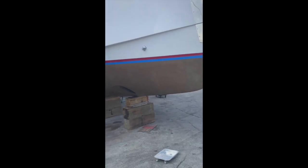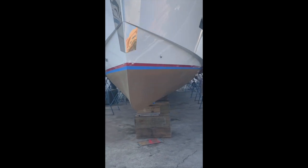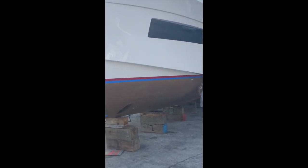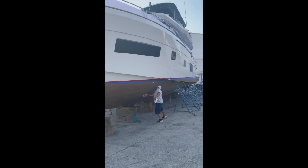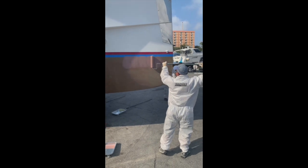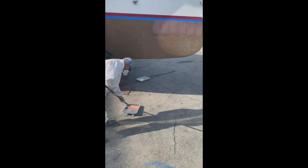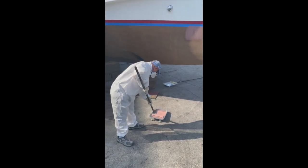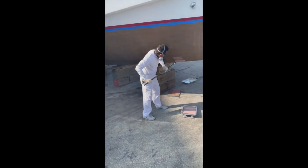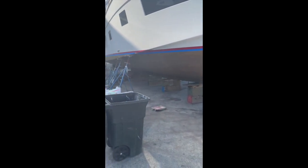Greg Cox and Brent Alsop over at RMK Merrill Stevens came up with a good plan of putting three men on each side of the vessel. One man on each side whose sole job was to mix the copper coat — mixing small quantities and continually mixing throughout the application process so that the copper stayed suspended in the material. You'll notice as the gentlemen are putting on the coats, the first one is very thin and you can actually see through it. It looks a little splotchy in spots at first, but by the second and third coats, and definitely by the fourth coat, it's a nice even copper-looking brownish color.